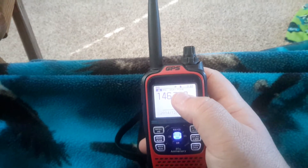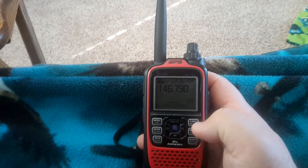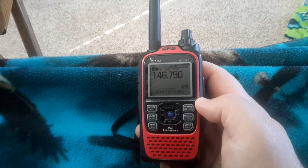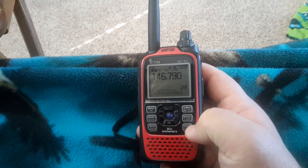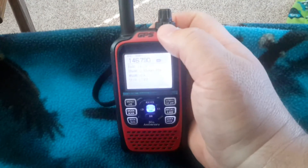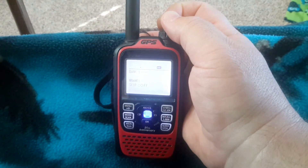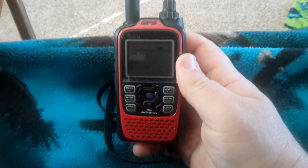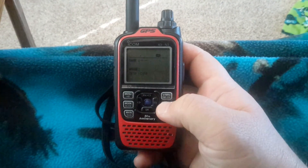You can see under the VFO you've got tone lit up. Then you would save your repeater as I showed you in the previous video with all that information in the VFO. I'll show it again by hitting and holding the M call button — that takes you to the flashing 75, which is the memory I put in before. I'm going to look for a new memory — 78. Pardon the moving around, this is how to do it one-handed.